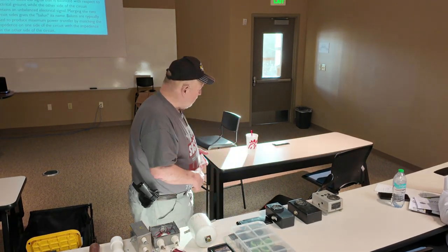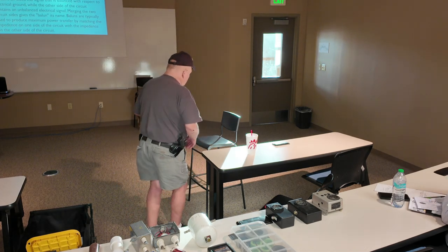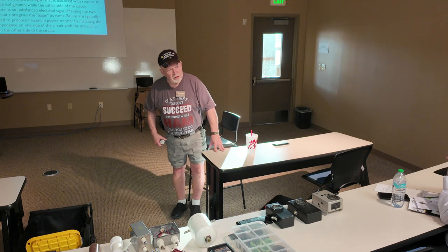I had that problem out at the Navy base. Because we're on the second floor, I ran a nice number 6 copper ground all the way from the second floor down to the ground and drove a nice 8-foot ground rod. Did it all right. But I still had RF because that ground was long and the coax was a better ground to the balun, and so it put it back out on the coax, and it came right in the shack and lights flickered and everything else. So I had to spend another $100 for a choke, put the choke on it, and the RF was gone. So you've got to be careful.